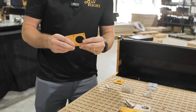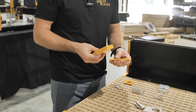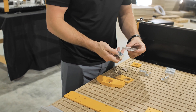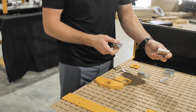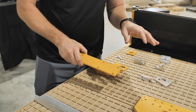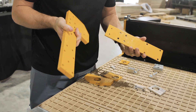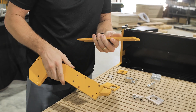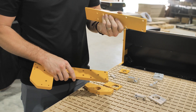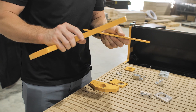On the motor mounts — this is the XY motor mount for the original Mega V, and this is the X motor mount on the Mega V2. You can see that's a huge difference — it's a lot beefier. We've got a more refined adjustment using an inclined plane for the Y mount, which makes it easier to adjust the gear rack to pinion gear mesh on the Mega V2 XXL and full sheet versions. This is quarter-inch steel here — you might see 14-gauge from some of the competition. We were already heavier duty, and here's where we're taking it with the Mega V2.